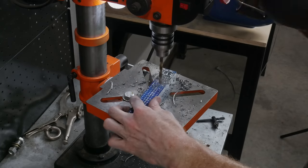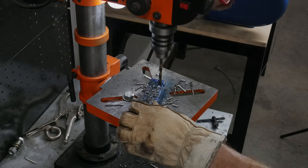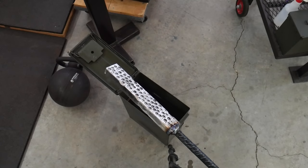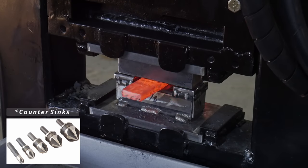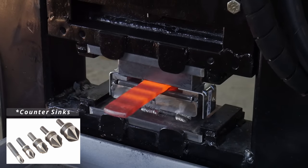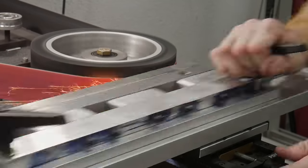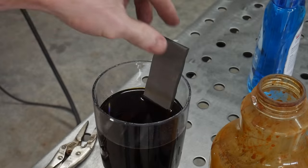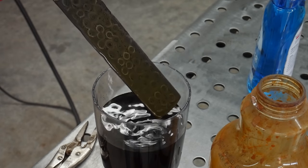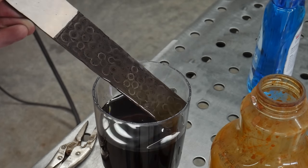I take a quarter-inch drill bit and drill holes on each side of the steel, shooting for holes around one-third of the thickness of the billet. One rookie mistake I made was not chamfering these holes — my counter bores have very sharp points and would bottom out before contacting the edge of the hole. I could have just used a large drill bit to chamfer them. This mistake resulted in grinding off even more steel, contributing to this knife ending up as a kitchen knife instead of a bowie.